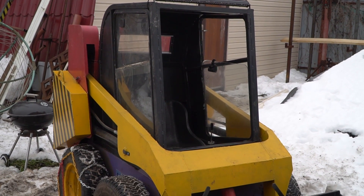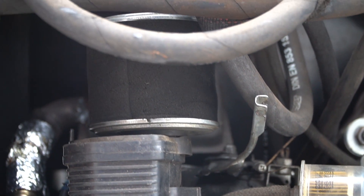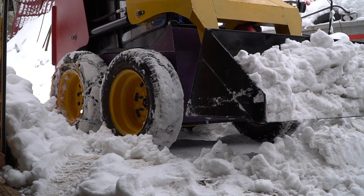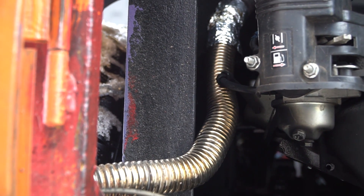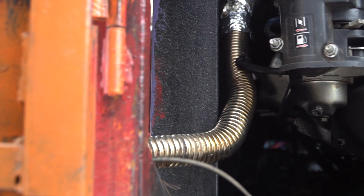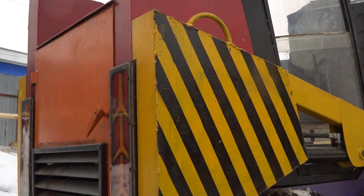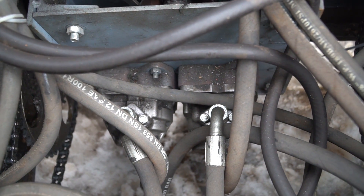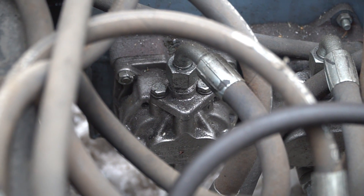Since I was making this skid steer exclusively for my own use, I find no sense in hiding the disadvantages, which turned out to be not that many. There were carburetor problems typical for most Chinese four-stroke engines. As you're practically working in the skid steer on the spot, moving back and forth and constantly breathing exhaust gases especially in calm weather, there's a need to route a pipe over the cabin, or better yet install an electric motor and forget about this problem — the loud exhaust issue would also be resolved. The loader nearly toppled over a couple of times until we set the counterweights; after their installation the problem was gone. I also noticed that the Chinese high-pressure pump is more productive on one side — the left side revolves faster and the hydraulic cylinders get filled with oil better. That's not critical, but it's better to use two identical pumps. That's all the drawbacks.